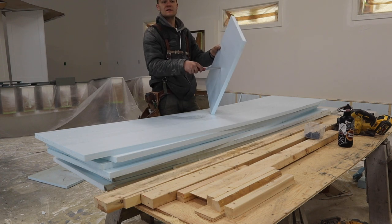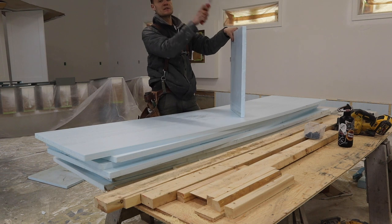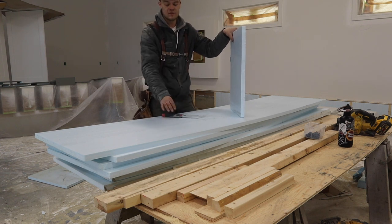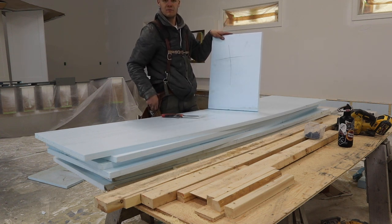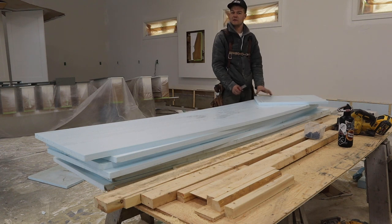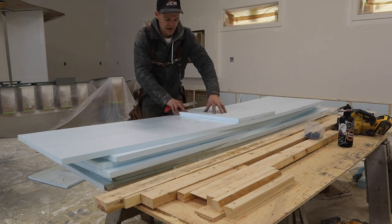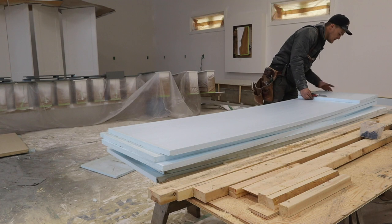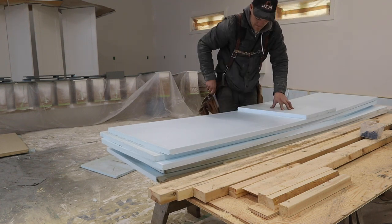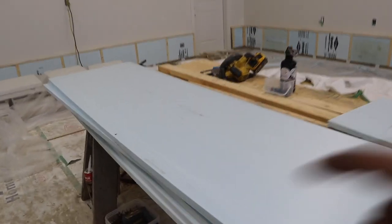Figure out how to do something quicker and do it. Cut one piece to the size of the hole — the whole foundation is set at 17 and a half inches, so set one piece at 17 and a half inches, never lose it, mark a T for template. You're going to always lose your template, so cut the rest of your sheets from it. Work yourself into a big stock of material so you don't have to keep running back and forth.